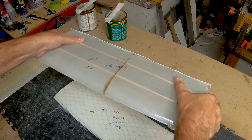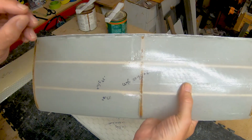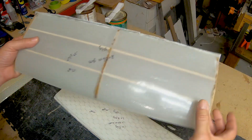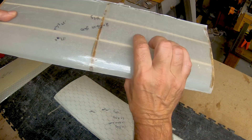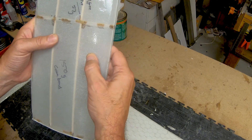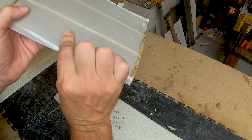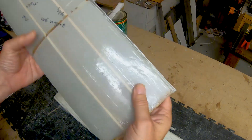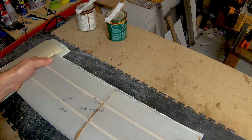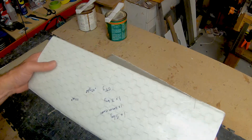And in bending. The fiberglass itself — because it's so thin, about half a millimeter — isn't very rigid, and you can see it flexes in between the ribs pretty well on this side, not as much on the other because it's a little heavier glass. But it's flexing quite a bit. It still has a lot of strength as a skin — we're going to do some testing to see how much strength, just to compare.